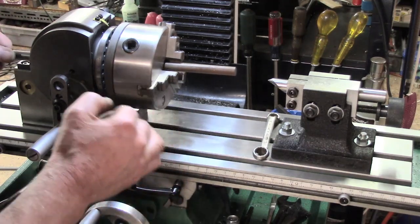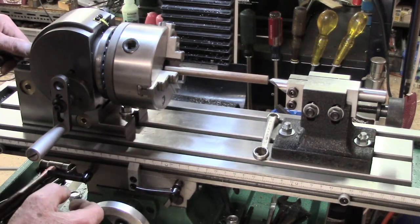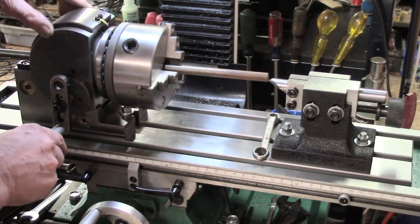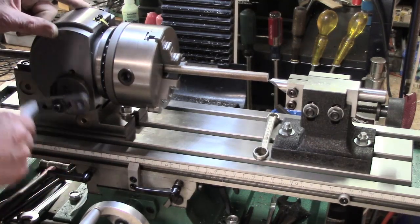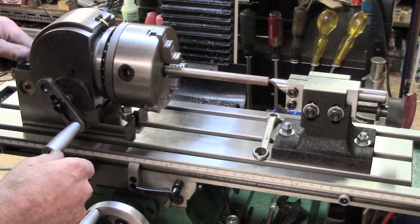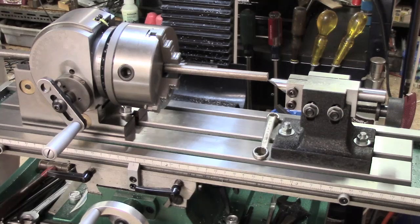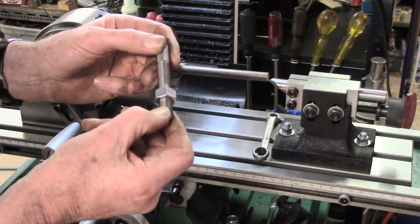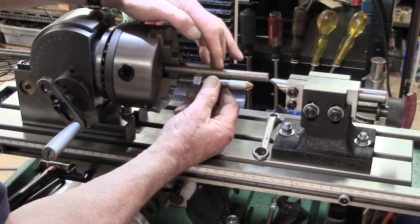The plan is - on a piece of half-inch bar I'm going to put a center in the lathe so I can put that on the dividing head center. Then lock up the chuck and, without using a dividing plate, I've got this scale on here which is a simple 360-degree division scale. We'll mill a flat on here first - if I get the old one, it has a flat all the way down. In this case we'll mill a flat up to near the end.